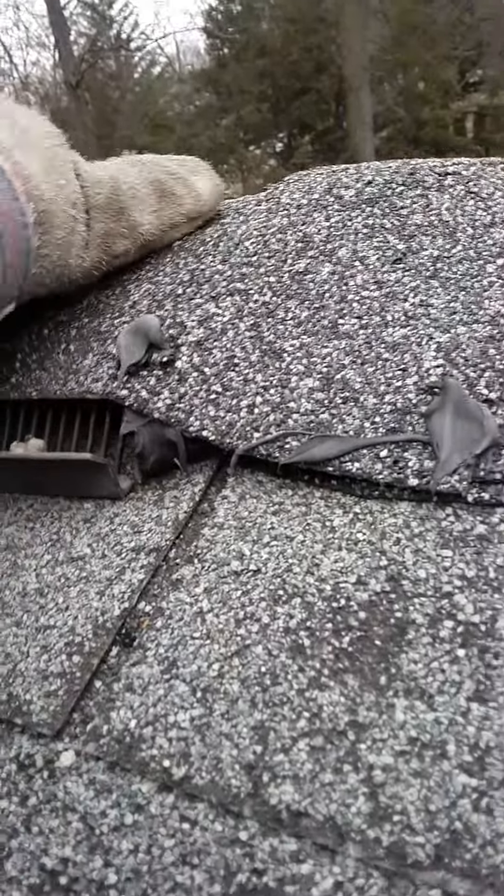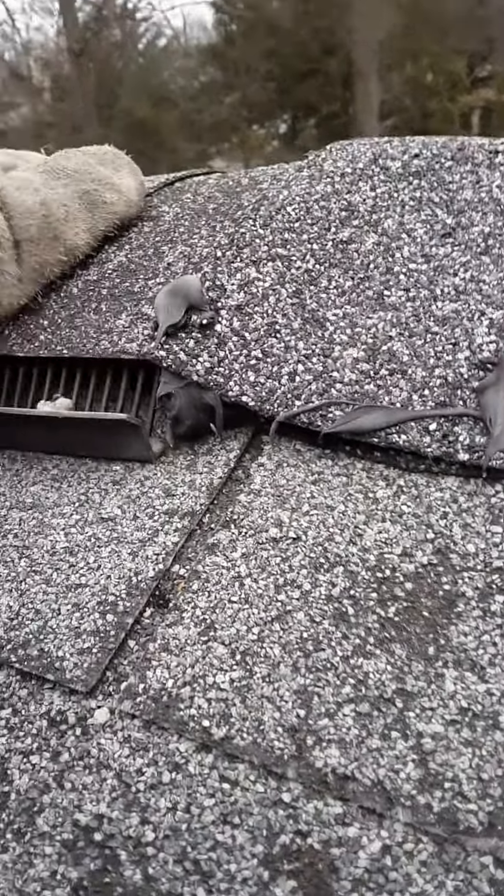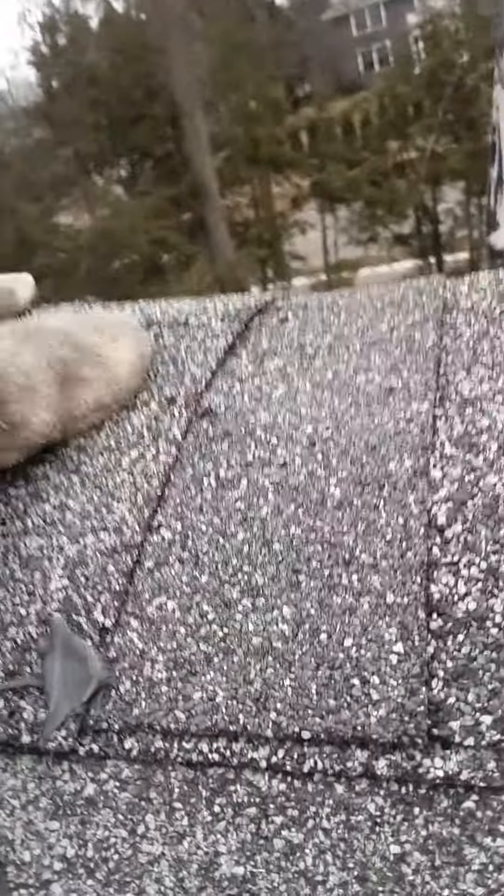Right here they just went to standard shingles. The problem is there are flat spots — look, see how flat it is here compared to here, how it humps. It's secure, it's sound here, but this is a little bit soft in a flat spot.